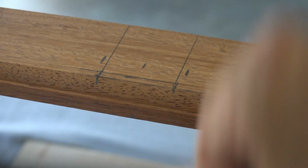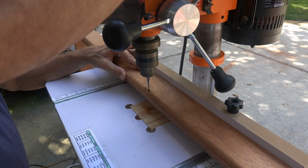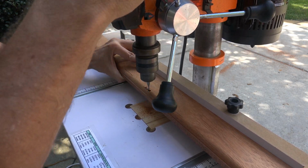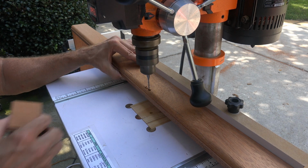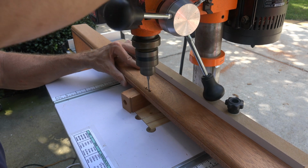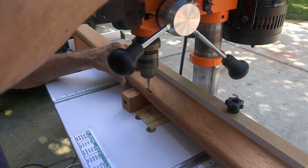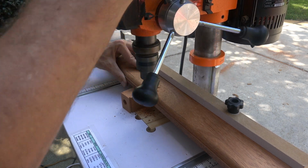We are going to drill our holes for the blade to pass through the frame. Start with the top and drill out your holes. I attempted to cheat here and use a router bit in my drill press. It got the job done, but it was not as easy as I had hoped. First, notice the frame is not laying flat on the tabletop. Well, that's because the bottom of the frame sat on the shoe of the drill press.